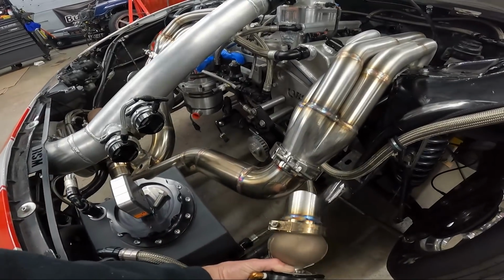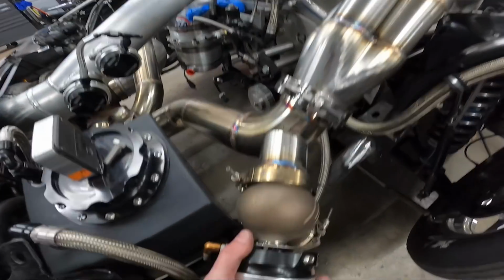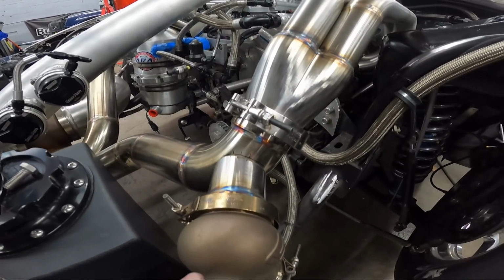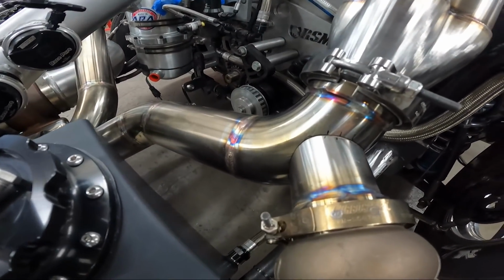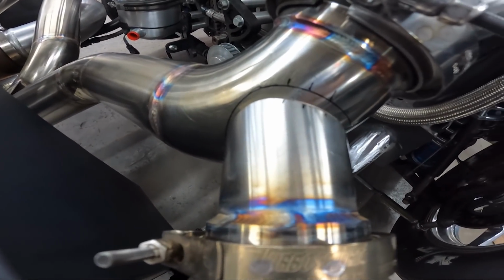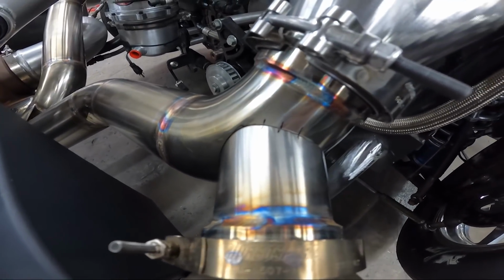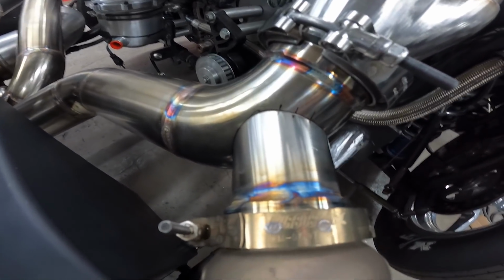So I took an angle finder and put on the face of the wastegate this little digital angle finder. I can't do it now because I only have two hands, one to hold the camera and one to hold the wastegate. But once I found that point, I put three lineup marks, and then I'm gonna move it down so you can see. I traced around the outline of it, so I can always come back to that spot.